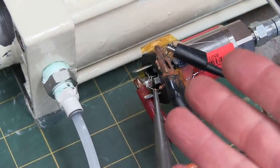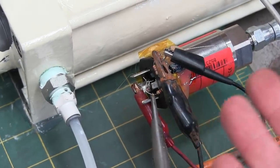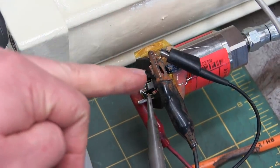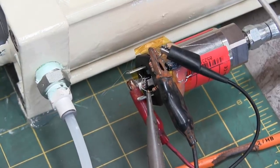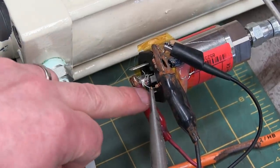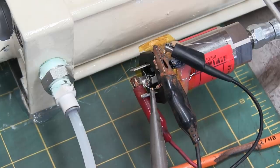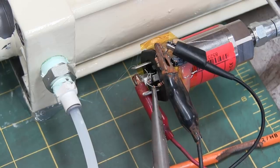We want a voltage drop that we'll be able to read without too much noise. That's about 10 volts, 20 volts, if at all possible. So this thing will run on 30 volts, and I got it running on 30 volts. You'll note that the low pass filter is no good at all on account of it being a current device. The filter didn't work. So I've just got the scope probe here on the plus side of the resistor, measuring the voltage drop across there. V equals IR, that means if there's 20 milliamps at 1,000 ohms, that gives us a 20 volt drop.